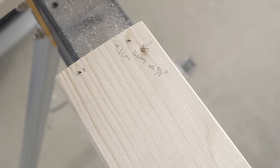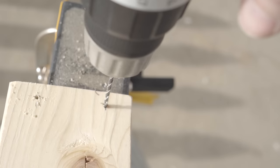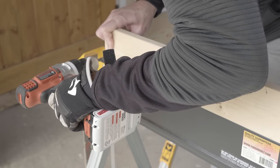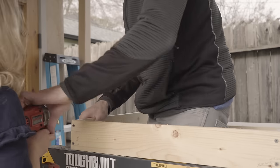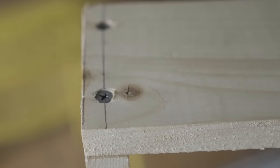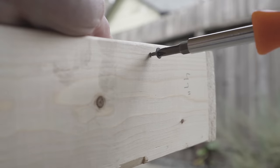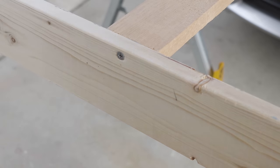Take the 24-and-a-half-inch pieces and make marks at one centimeter in from the cut sides and two centimeters from the other sides, then drill pilot holes in each of those spots. Line up the top and bottom pieces with the side pieces and drill into those pilot holes to create perfectly aligned pilot holes in your side pieces. Put your screws into the four corners of your frame — you now have a strong basic frame with countersunk screws, no glue necessary. Take the corner pieces, cut the ends at 45-degree angles, and attach them by drilling pilot holes and inserting one screw per side. Then attach the back piece the same way — pilot holes, then screws — and your frame is complete.